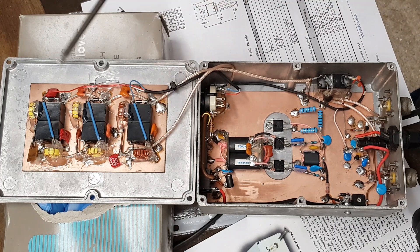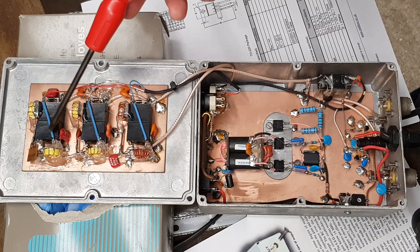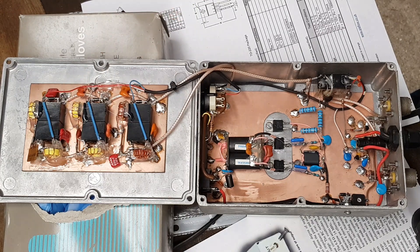If we move across this way, we've got our filters here. A 40-meter filter bank here for the low pass, two relays back-to-back. Then we've got the middle set which is 20 and 17 meters, and 10 and 15. So this is how I've made my construction for the build — it is a blank canvas because you literally start with nothing more than a piece of copper board, so you can lay it out how you like. This worked well for me.